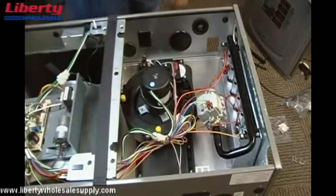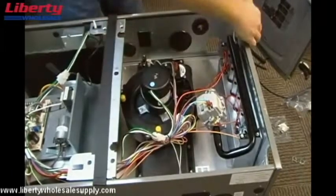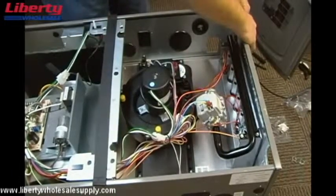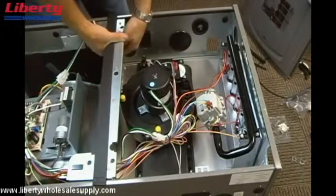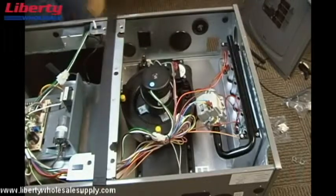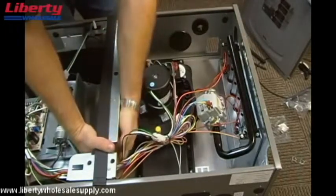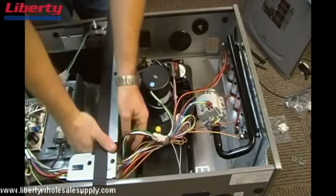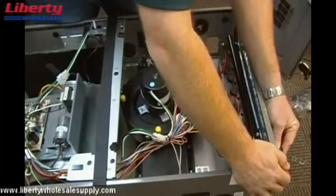The next step is to take the 2 and 5/8 inch plug that is in the RXGY-CK kit and install that in the top of the furnace on the left hand side. We'll next remove the plug in the blower shelf and discard that. Then we will go to the other side and take the plug out of the blower shelf on the right hand side of the cabinet and install that in the top right hand side of the jacket.